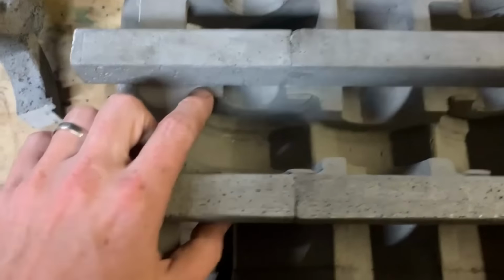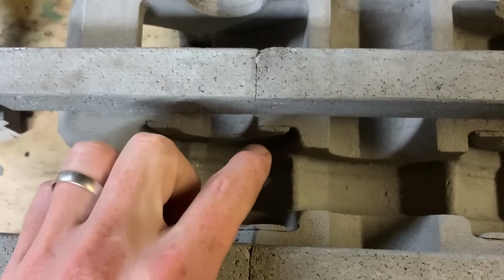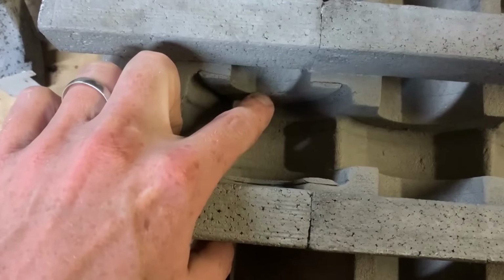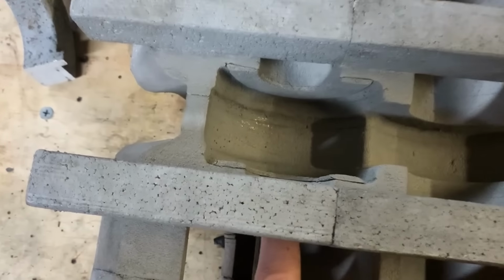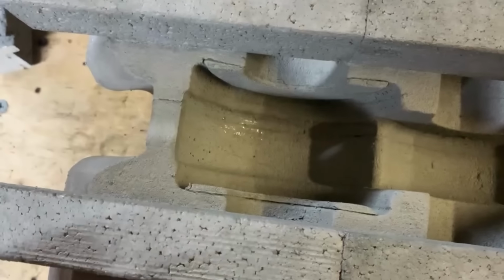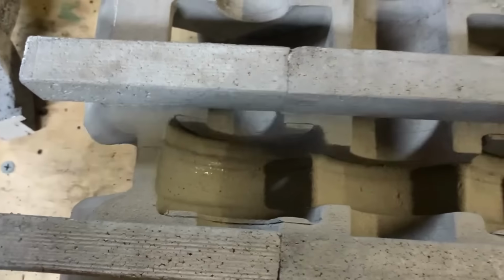But yeah, there's another couple of nasties. These were glued in after the fact, just little discs, because I realized the lip seals were a couple mils larger, so I had to add 2 extra millimeters of width. So when I machine through, hopefully it cleans up along those edges. But at the end of the day, it's just for a lip seal, a bit of extra support.